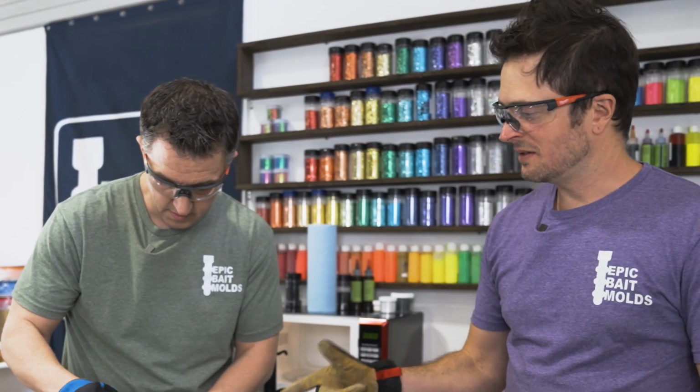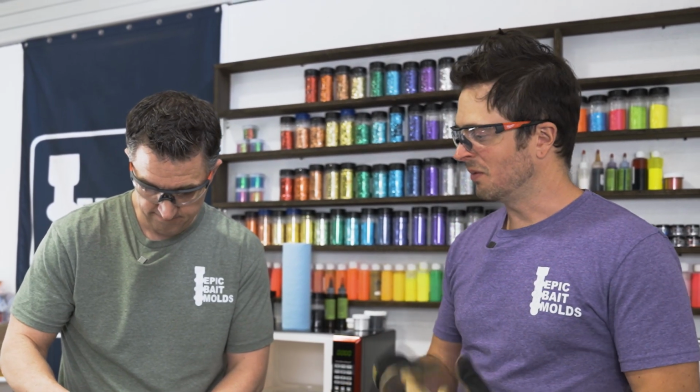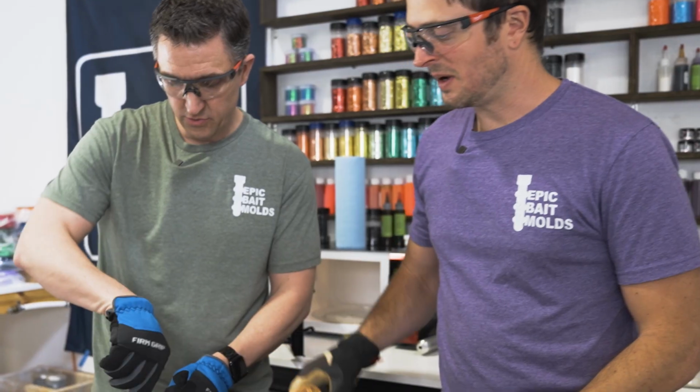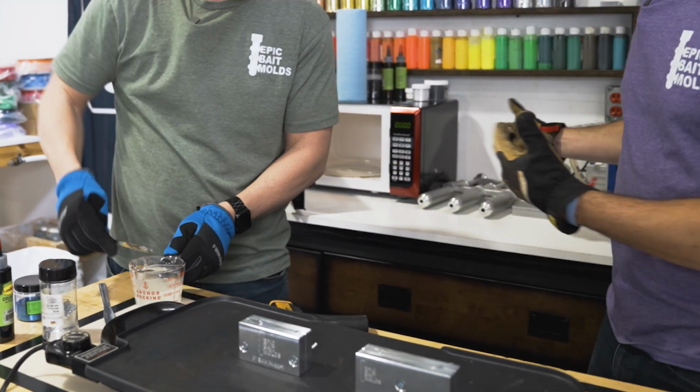Yep. So we got the second cup of plastisol. We're heating it up just like the first cup. We're going 1 minute, and now we're going in 20-second increments. Right now we're at, not even 300, yeah, just under 300 degrees. We're gonna put it back up, get it to temperature, and then degas it.